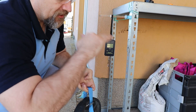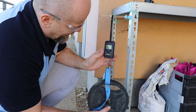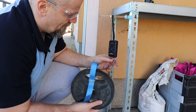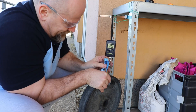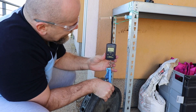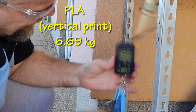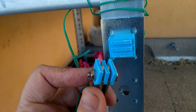This is the PLA with horizontal layers - this should be the weakest. I need a bigger weight. It's bending a lot... I heard a crack at six kilograms. As expected, layer adhesion failure - but six kilograms, more than six kilograms, not bad.